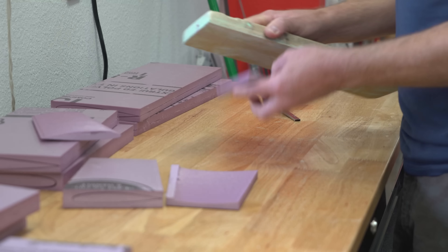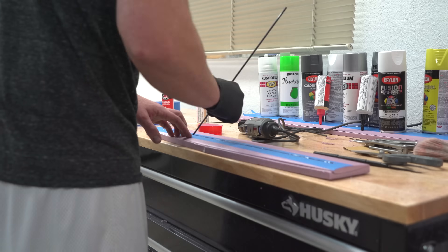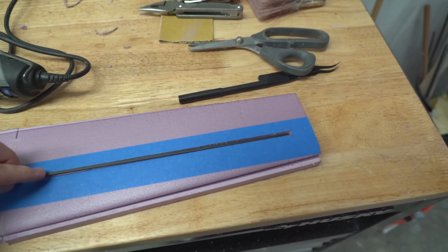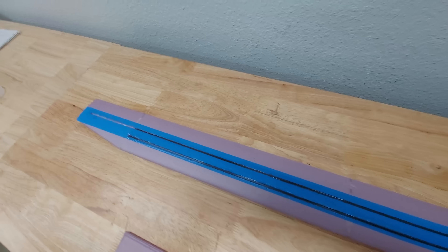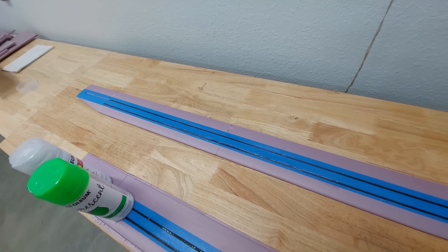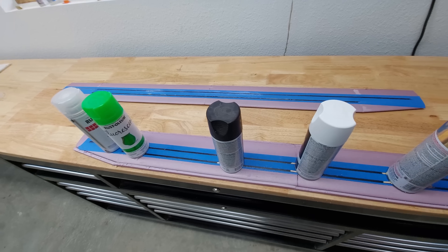Next up was the main wing and rear wing. The main wing is a somewhat laminar-type foil shape I designed in Flow 5; the rear is a symmetrical NACA foil. For the rear wing I put in a 4x1mm carbon rectangle as a spar cap, then flipped the wing and made a channel for a 3x3mm carbon square rod to act as the shear web, capping that with another 4x1mm carbon rectangle. I mixed up enough 5-minute epoxy to set this all at once, but it set up on me before I could get the spar seated — pretty much destroyed that. So here's the new main wing; we went with longer-setting 12-hour epoxy this time.